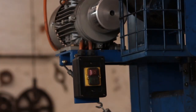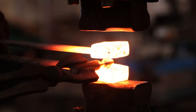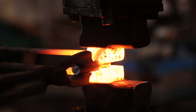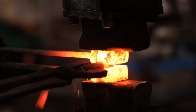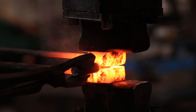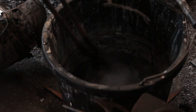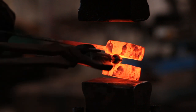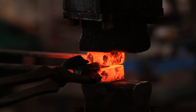With the swage up to temperature, we'll go under the power hammer and I'll place the acorn centrally and start hammering. I'm going quite slowly because I don't want the acorn to jump about, and you can see I'm rotating it as I go along — that'll just even out the shape. Make sure you keep it cool because if it heats up too much it'll start deforming and that'll upset the whole pattern transfer.